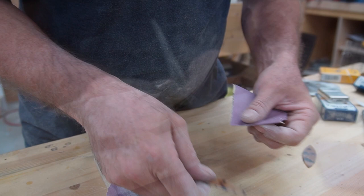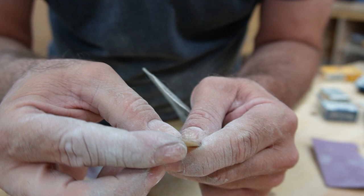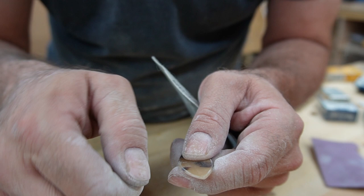Propeller or something almost. So you've got these two flat surfaces. You've got one bevel on the bottom going this way, and then another matching bevel on the top going that way. So when you offer them to the strings, even when your pick is angled, you get kind of a rounded face to ride off of, and that's what we're going for.